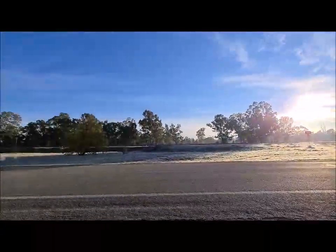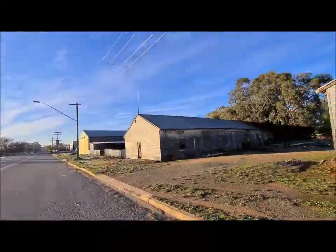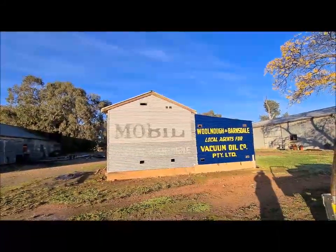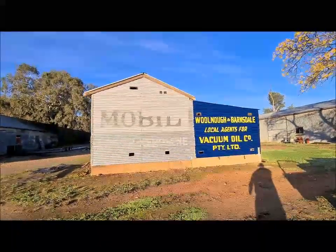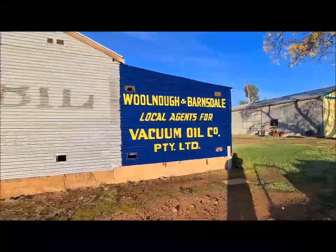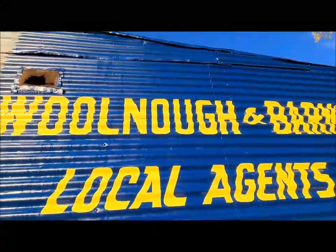Good morning, everyone. We're back down here in Ganmain for hopefully the last day for this job anyway. We're almost done. As mentioned in the previous video, I was a little bit worried that dew, or moisture, frost, whatever you want to call it, settled last night and would have made this paint run, but I think we're all good. There's no obvious runs, there's a bit of moisture sitting on it, obviously because the wall's wet. You can see there, it's all still drying.